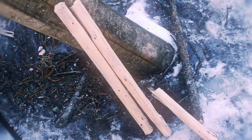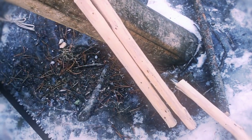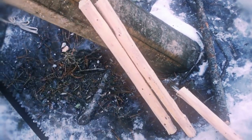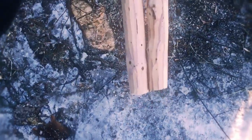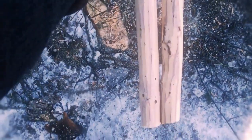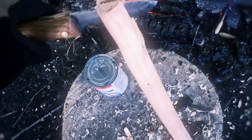From the thicker part of your downed little spruce tree, you need two elbow-to-fingertip length sections. Now what you do with your handle is — they won't be perfectly straight — so what you want to do is roll them until you find there's a little bit of bow there. Have them at the widest spot so that the bow is facing inside, if that makes sense. Otherwise your handle will roll. I've used the knife to split down.